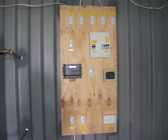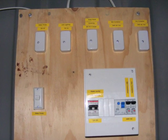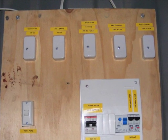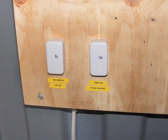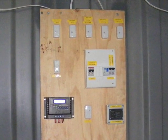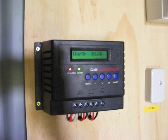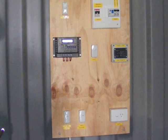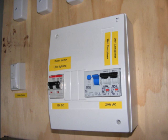I've made an electricity power board. It's made of 1 inch ply and it has connectors across the top and the bottom for all of the inputs and outputs so that it can be moved when I put it into its final resting place. The electricity comes from the solar panel in the top centre connector to the charge controller and then down to the bottom left hand connector which connects to the battery.